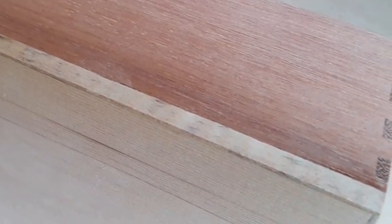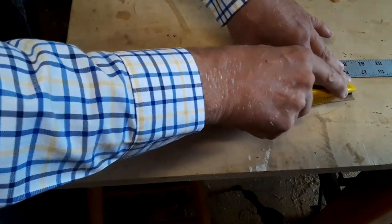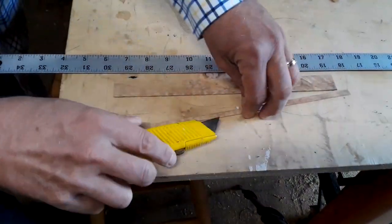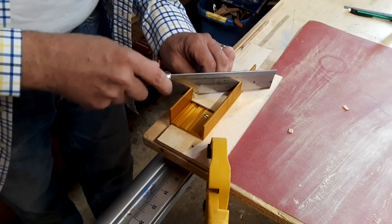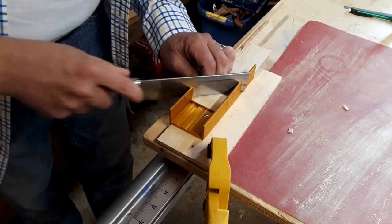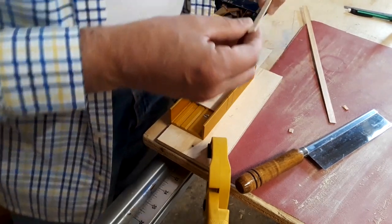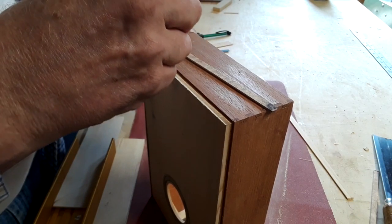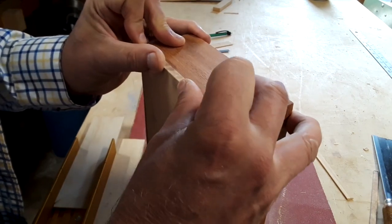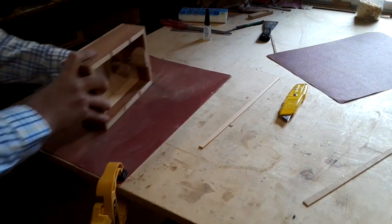This project is a learning exercise, so I decided to dress things up and put bindings on the box. I cut my bindings from some spalted curly maple to match the rosette, the fretboard dots, and the laminations on the front and back of the headstock. The ends are mitered close to the line and then sanded to size. The large sheet of sandpaper is for a floor sander and comes from the tool rental department at Home Depot — it's 12 inches by 18 inches with a very heavy backing, so it lasts longer than regular sandpaper. The edges of the box were routed on the router table; I super-glued the bindings into place and sanded them down flush with the box.